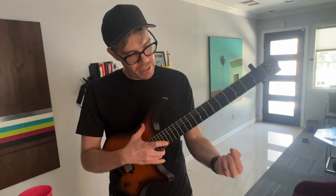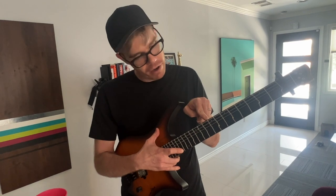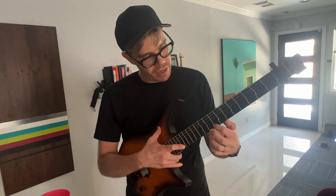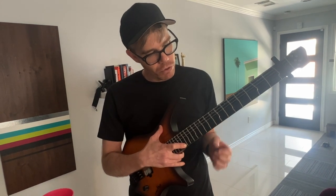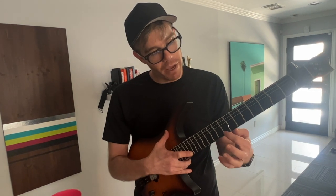And if you have feeler gauges, they allow you to measure the distance. So you're going to look at the 8th fret here. You don't really need feeler gauges. All you need to do is just kind of tap, right? You want there to be a tiny little bit of play, but you don't want it to be stuck, right? That means you've got back bow. But if there's too much play when you're tapping it, like whoa, whoa, whoa, that means you've got too much relief. You probably want to adjust one way or the other based on that. Via the truss rod. Via the truss rod, correct.